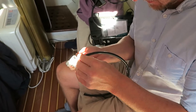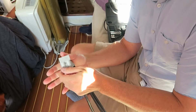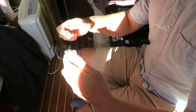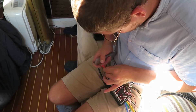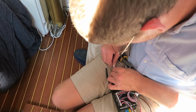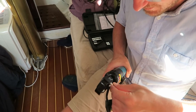For the Anderson connector to latch properly it needs to have two lugs in it even if one isn't used. So that's our three phases and we can screw those to a piece of wood, and then when they go together that's how they click together - for a reasonably positive engagement. With the cable this short you want to make sure that you get your crimp oriented the way you want it, because otherwise you probably wouldn't be able to twist it very successfully.